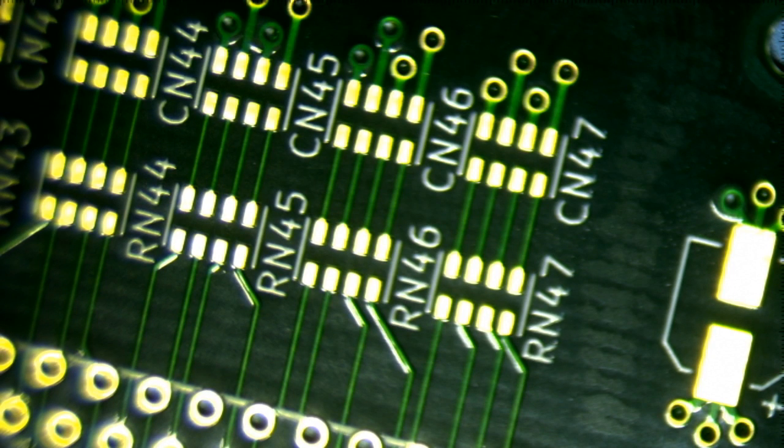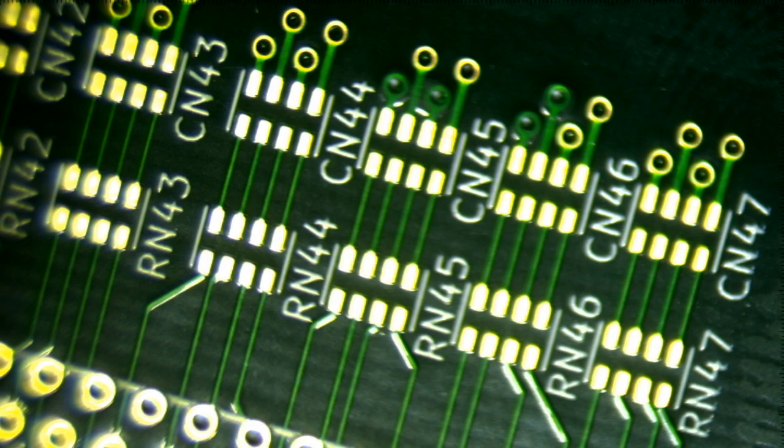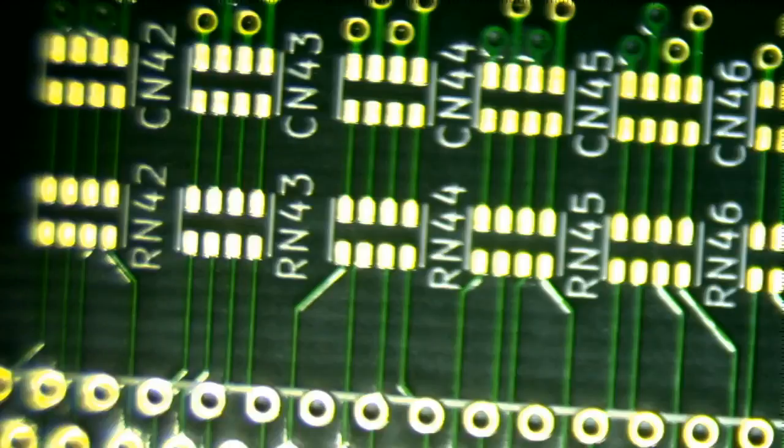Let me actually type in the part number. It's an NXP PCA9698DGG. And it's I2C input. Now you'll notice that I had 4 chips on here. 1, 2, 3, 4. Anyway, you can select the I2C address. I think you can select one of 16 addresses or something by connecting 3 input wires to either ground or VCC or the clock, believe it or not.